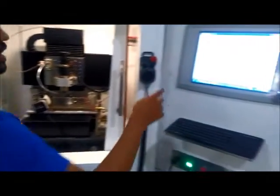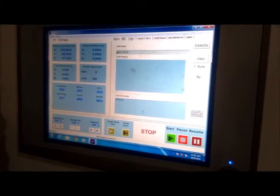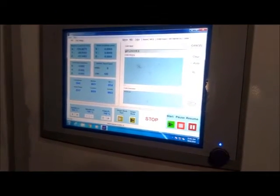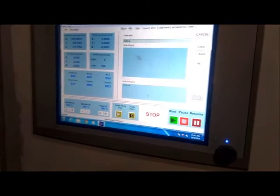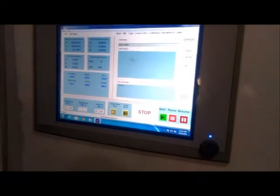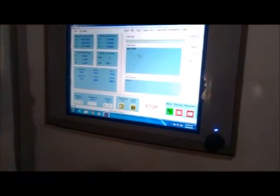Now before starting the operation, I have to again give the command G01 Y. Let us say I have to move Y by 10 at a set feed rate. In EDM we have to keep feed rates very low. Before that I will increase the spindle speed from 100 to 900, and for that I will be using the command M03 S900, that is clockwise spindle and S is 900 rpm.